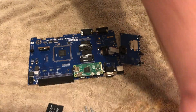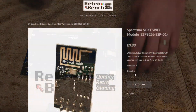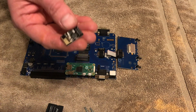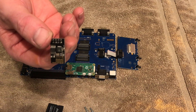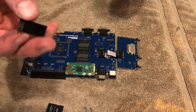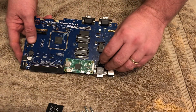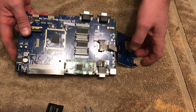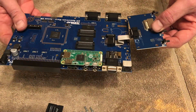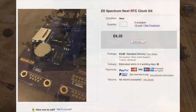So, as you can see, we have a Wi-Fi module fitted, ready to go. Now we have a Wi-Fi module fitted, ready to go and there it is. We're going to be popping this into the TB Blue motherboard and making sure it's in the correct orientation. Quite important - I can't get it wrong here because the Raspberry Pi is in the way, so it only goes one way, pointing towards the SD card. Nice and simple, nice and easy, can't really get that wrong.